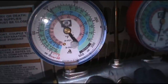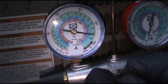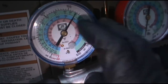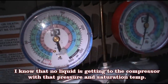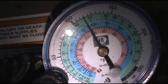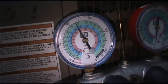Just going to get her cooling tonight and then come back tomorrow morning first thing and break out the old sniffer and fix the leak. It's a ton-and-a-half Goodman and they all sit around 40 saturation — about 115 PSI. I've got it memorized, I've been working on them for five years. I'm going to let it rock and roll there for tonight, get her cooling, and then come back and do a leak check first thing tomorrow morning.